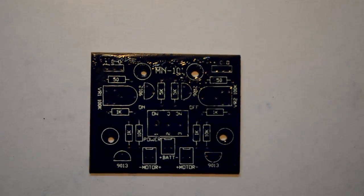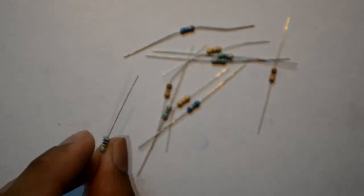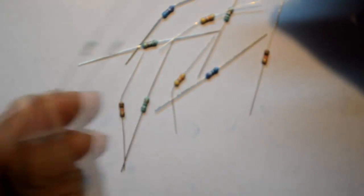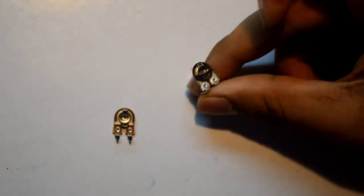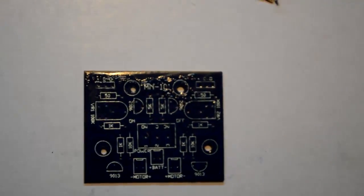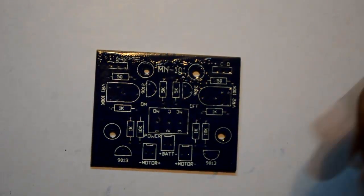Now let me show you all of the components. These are all your resistors, ranging from 50 ohms to 100k ohms. With the help of the BB Roy of Great Britain mnemonic — the famous resistor color code chart — you have to recognize the values of each resistor and accordingly solder them. Here are the presets; both of them are 100k ohms. These are used to adjust the sensitivity of the LDR which is used as a sensor. One is for the left and the other is for the right. You may see they have two special preset slots on the PCB so you can easily put the presets in there.